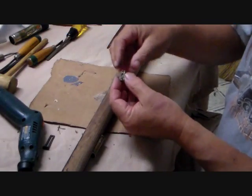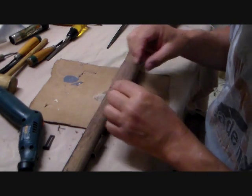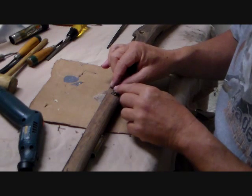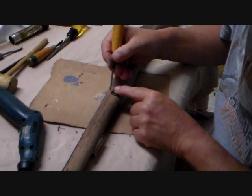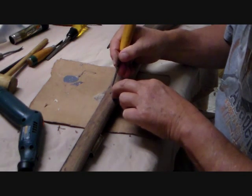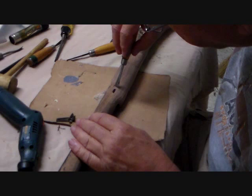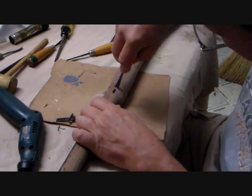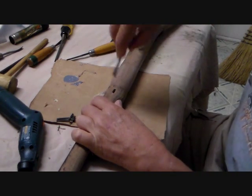Okay. So this is now ready to put in. And so we place this over the hole. And we additionally index it with a barrel wedge here, okay, and scribe the outside edges. We need to put some stops on here. So you take your chisel and find your lines here and push straight down. Now, by happenstance, the chisel width here is almost exactly the width of the cut, so that makes it nice.